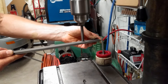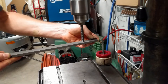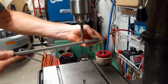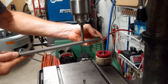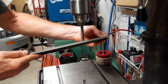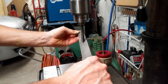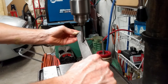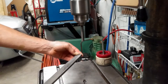I usually start at the bottom. You can't go quite all the way flat with a file like that, because if you do it'll try to wander all over the place. Get it to almost flat — you can get that bottom burr off, just move around a little bit so the chips don't gather too much. You can see the chips gathering on the file there — just a little bit of movement takes care of that.